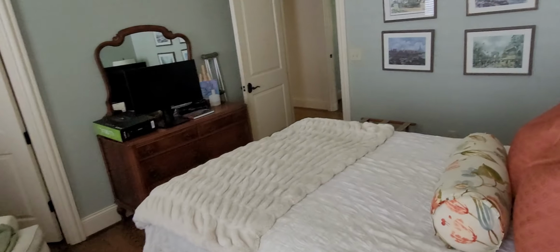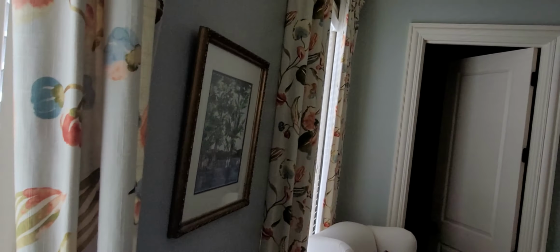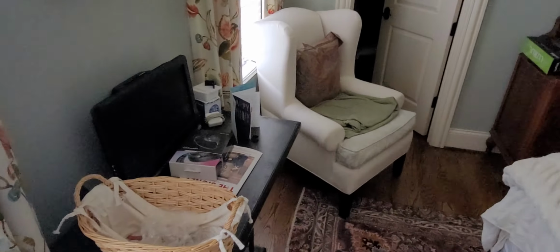All right, she has to go to work. I'm gonna upload this. Remember, this room is probably the most vulnerable that I see. So cut, wrap all of this in plastic, everything. Take these drapes, roll them up. Don't take them down, roll them up and then wrap them in plastic. Careful not to put tape on the fabric, so that way when we undo this, there's no dust.